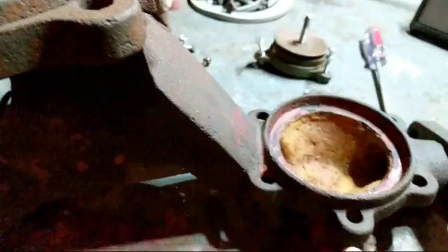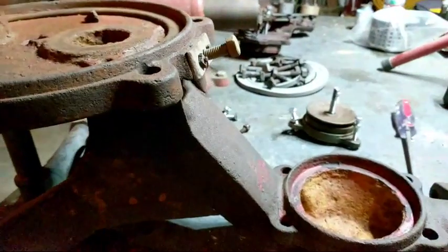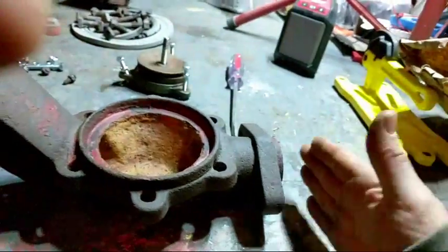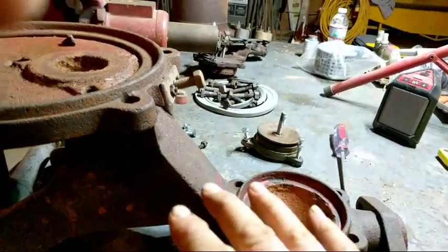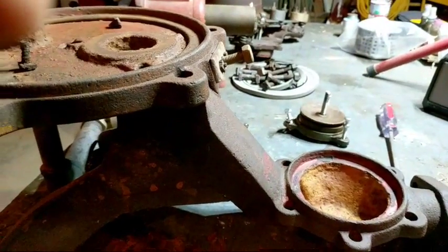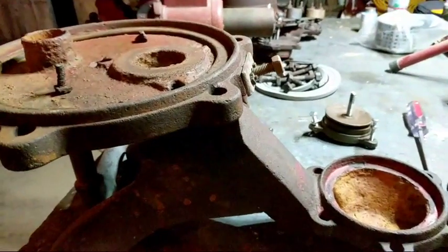So it's a combination of 2 valves. This is like a human heart, except it's a 2-valve heart. And when the pressure leaving the ram through a delivery valve and the pressure coming in from the drive pipe equalize, this thing runs automatically. So it's kind of like your arteries and veins. And if your pressure is right, the valve and your heart keep working. So that's a good thing.